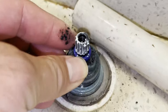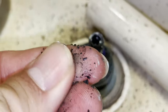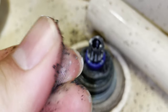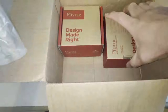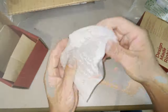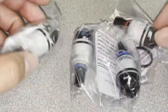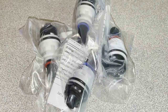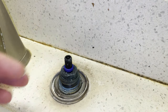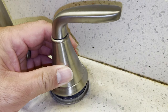All this black stuff is the degrading gasket, which is the cause of the tightness. After five days, I received two sets of handles and two sets of brand new cartridges completely free — Pfister even covered the shipping charges. If your faucet has been dripping or the handle spins 360 degrees, this is a good time to replace the cartridge.